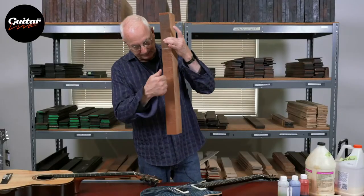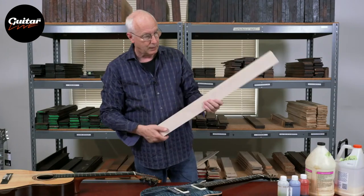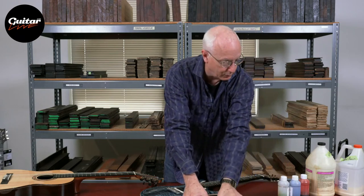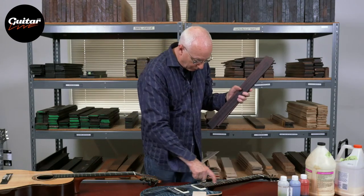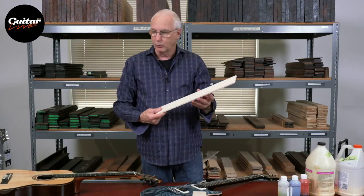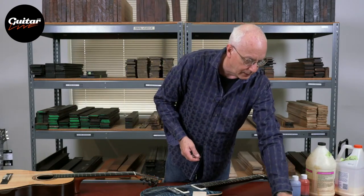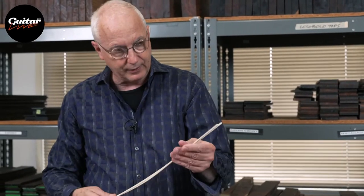It's a little bit complicated, but let me go into it. You start out with a blank of wood — this would be a beautiful piece of mahogany, or you can use a piece of maple or curly maple. This would be the rough wood of the fingerboard, the piece on the guitar that the inlays go into. You can make that out of maple, rosewood, or ebony. And if you want, you can put pieces of plastic down each side of the neck — this is called binding, and we use binding on some of our instruments.